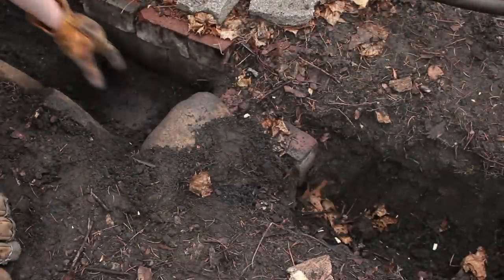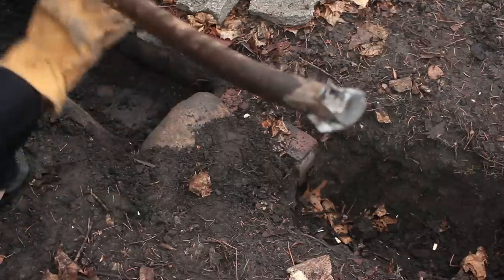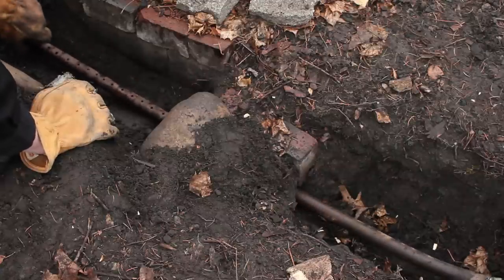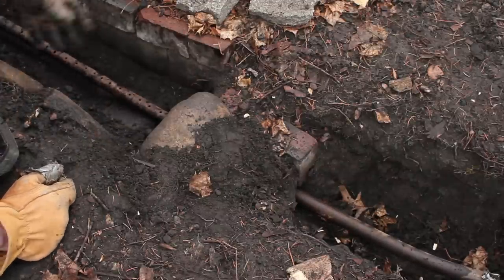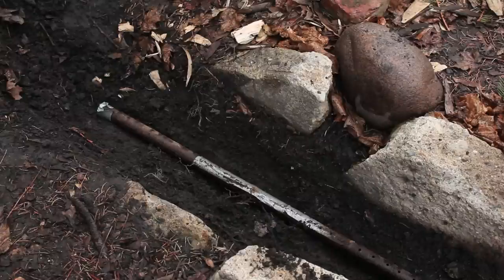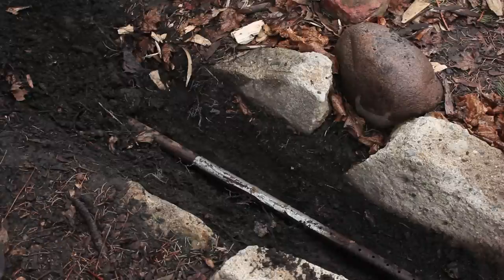You've got your forge here and there's a secondary trench right there. All you've got to do is put the tuyere through the divider wall. There are your air holes — that's where your charcoal is going to be. Then you attach your bellows to that end. The opposite end of the pipe you seal off with duct tape.